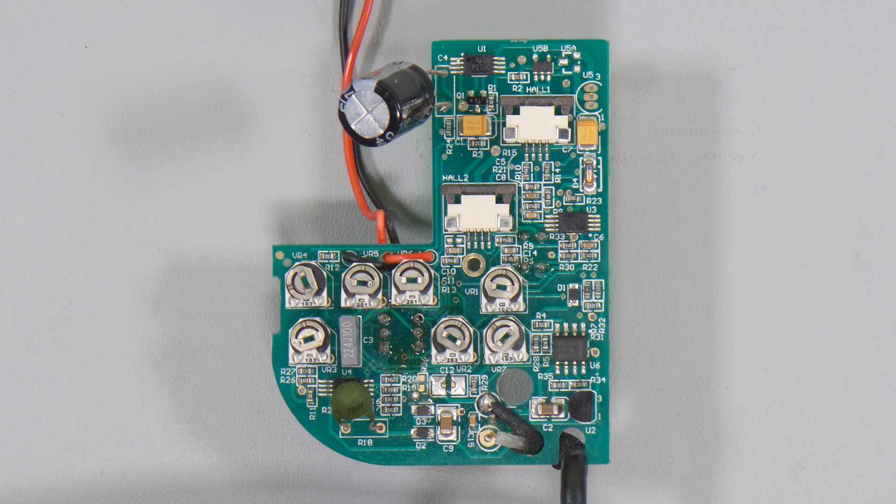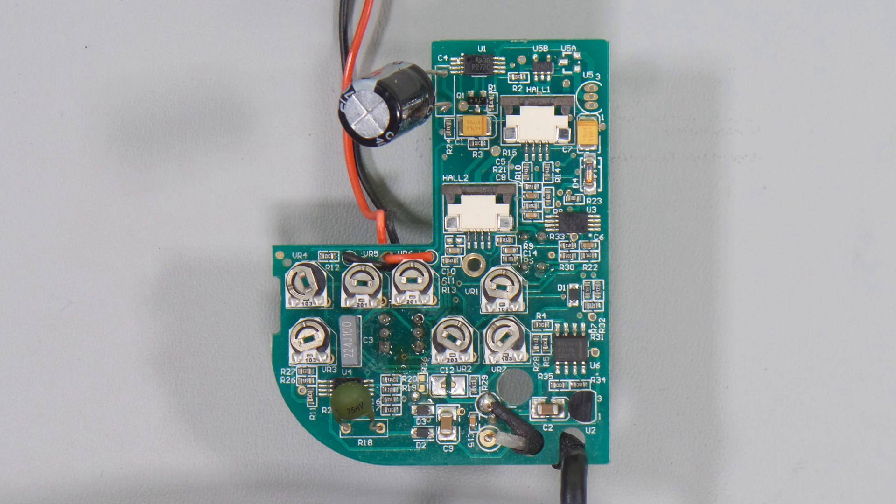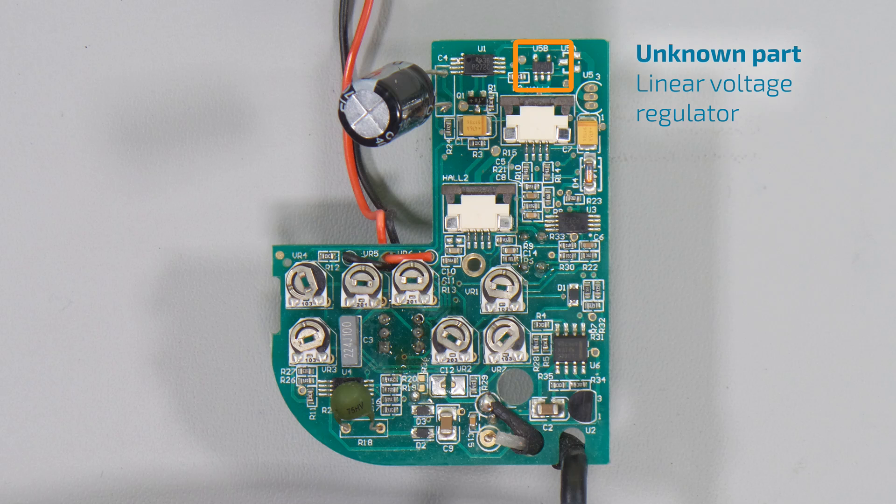Here's a close-up view of the main PCB from the clamp meter. You can see it's mostly surface mount with a couple of through-hole bits and pieces. It's very analog - no digital circuitry, no microcontrollers, just all analog circuitry. It's quite hard to trace because parts and traces go in and around underneath components and vias everywhere. At the top there's a five-pin device I couldn't fully identify, but I believe it's a linear voltage regulator. It looks like the nine-volt battery goes through the main switch and into this device to power the rest of the board.